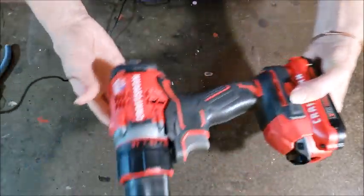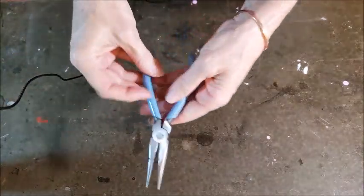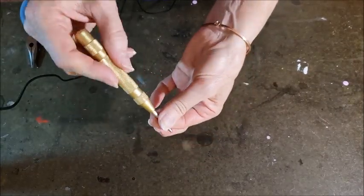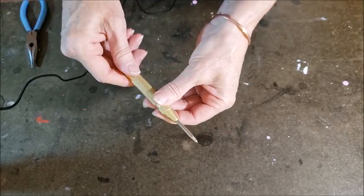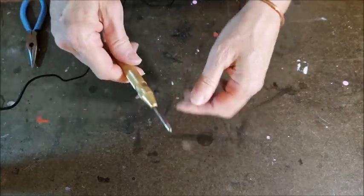This is a very simple project, but you do need a few power tools. So I have my hand drill here. I've also got some needle nose pliers. And this tool is called the center punch. You don't have to use it, but it just makes it easier — it marks the holes where you're going to drill and it makes it so the drill doesn't slip around as much. They're really cheap, three, four, five bucks. I recommend having this in your tool kit as well.